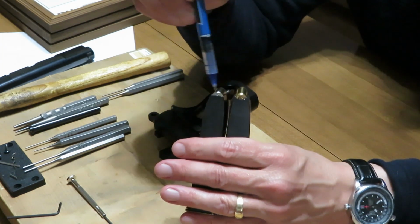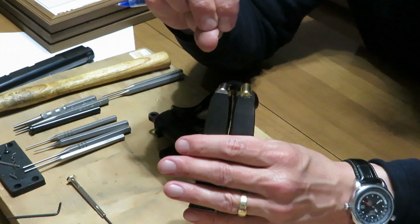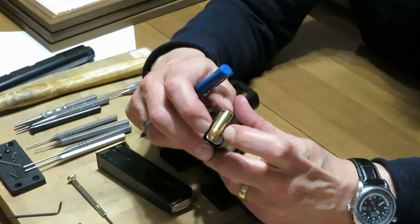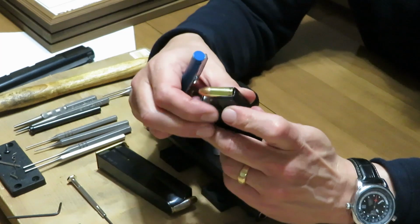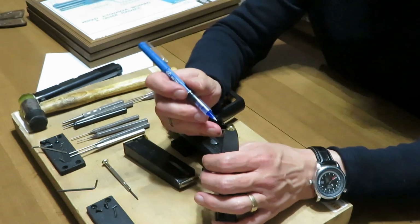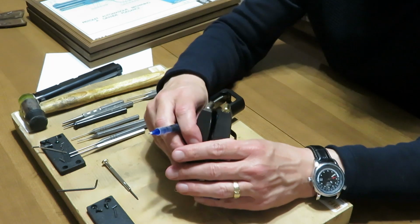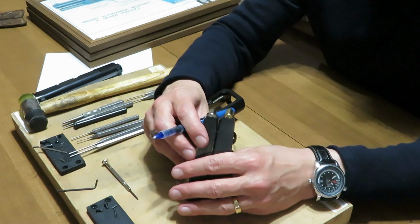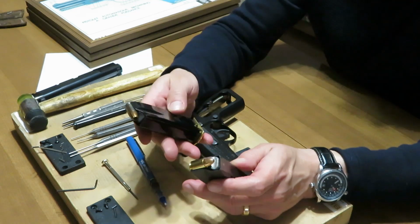And this was changed over the years. The original design had even more of a tendency for the feed lips, and those are the part of the magazine right here, to start to weaken and start to spread. And one of the big reasons the older magazines' feed lips would weaken and spread is because this missing metal allows that to happen. It makes it much easier for that metal to weaken and fatigue because there's just not as much holding it. So this is one thing that over the years got better and better, was magazine technology.